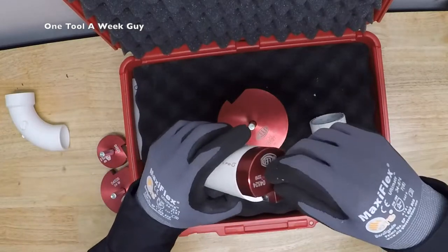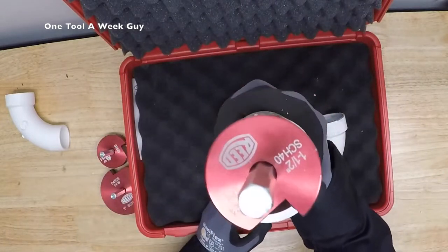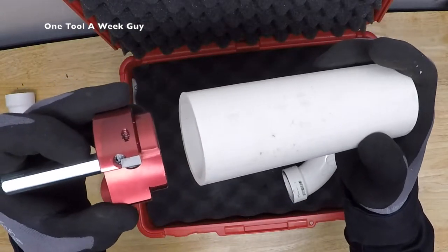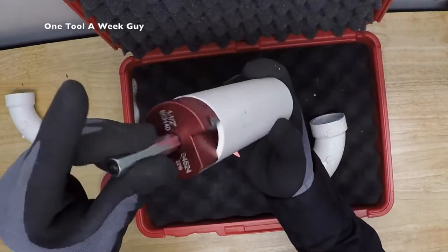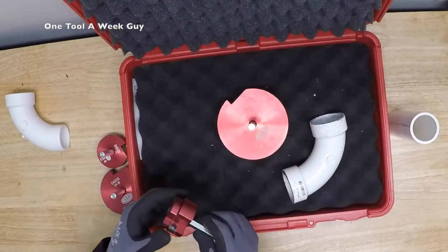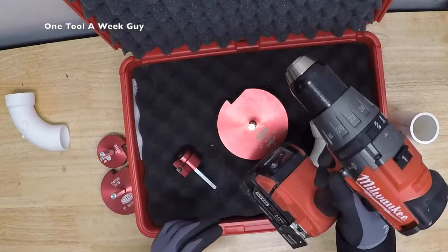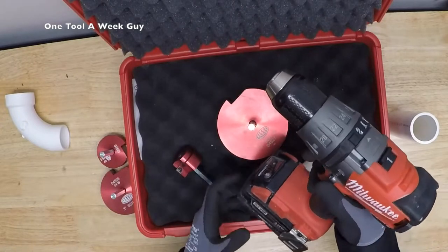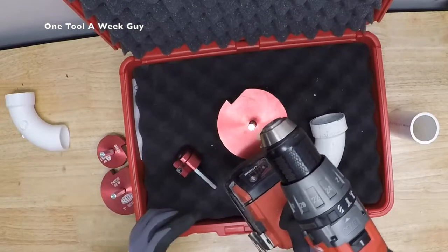As you can tell, it's going to be just about the same OD and ID diameter. I have an inch and a half fitting right there so it goes flush, and inside it has a little lip which fits inside the pipe and it reams as you twist it off. It fits your standard half inch drills — I used my regular Milwaukee drill. You're supposed to use it with a high torque, low RPM drill setting to reduce heat from friction and provide the cleanest cut.